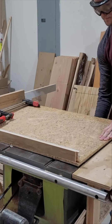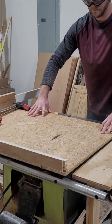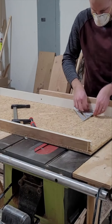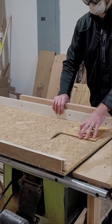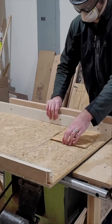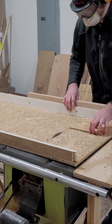The way you make the sled is you start off with just a flat sheet, bring the table saw blade up through the sled itself and make a bit of a cut — that's your reference line. The goal is to set up a back fence that is as perpendicular as possible to that table saw blade. The way you do that is you get a little square board and make several cuts past the table saw blade using the back fence as a reference. You make one cut, then rotate it using the cut side you just made as a reference, and make another cut, rotate it again, make another cut — you do this five times.